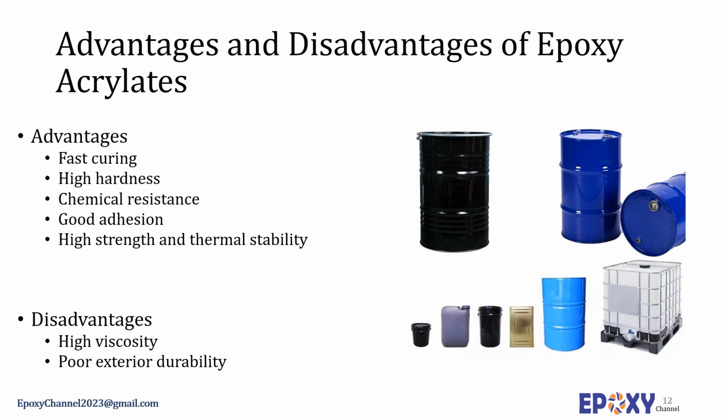Various factors such as molecular weight distribution and functionality will affect the viscosity, but strong hydrogen bonding through the secondary hydroxyl is reported to be the main cause. The end result is that a formulation often requires a high percentage of reactive diluents to obtain a viscosity suitable for the applications. Capping these free hydroxyl groups reduces the resin's viscosity, but often at the expense of film properties, and modest improvement may also not affect formulation viscosities. Such high levels of diluent can cause film brittleness and shrinkage to become a problem depending on the type of the functionality.